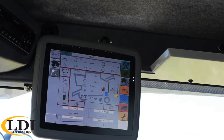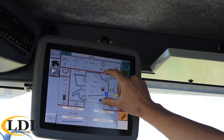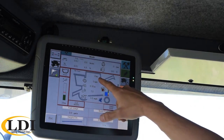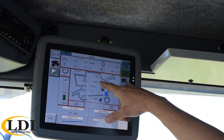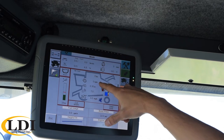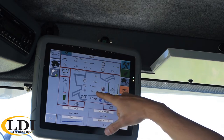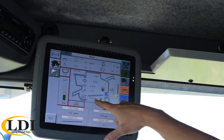As you can see on the monitor, it's a pretty simple monitor, easy to read. The first thing that jumps out is the picture of the combine, and that makes it really easy to see what your readouts are. The top number is your grain bin current level in bushels, below that would be your rotor speed, below that would be your concave clearance, below that would be your fan choke setting, and below that would be your ground speed.